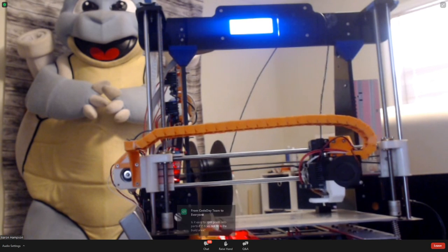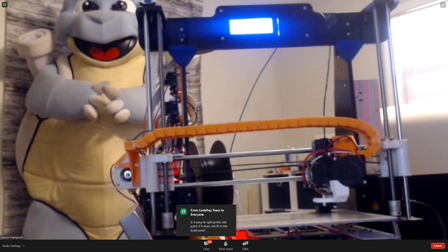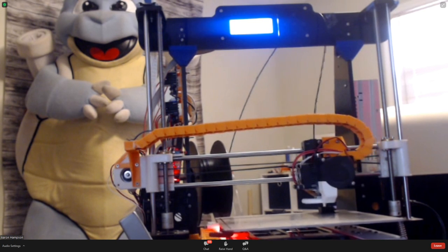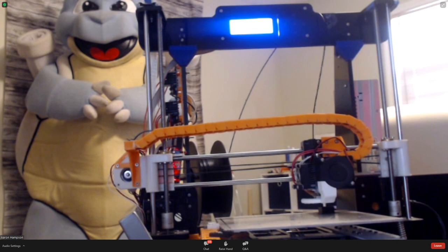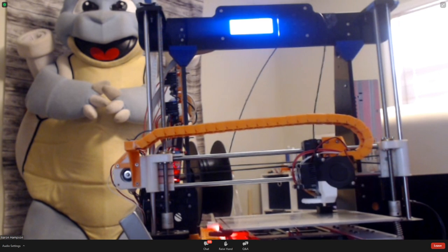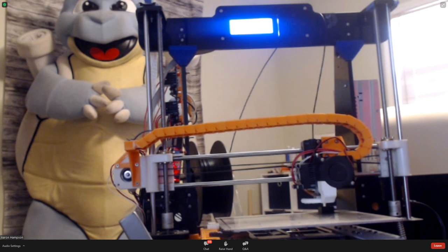For printing moving parts, you'll have to identify which parts are going to be moving and then make sure those are separated and design the model in a way that you could put it back together so those parts are free to move. If you're thinking like the wheels and an axle on a car, you want to make sure those parts are separated so it can rotate freely.